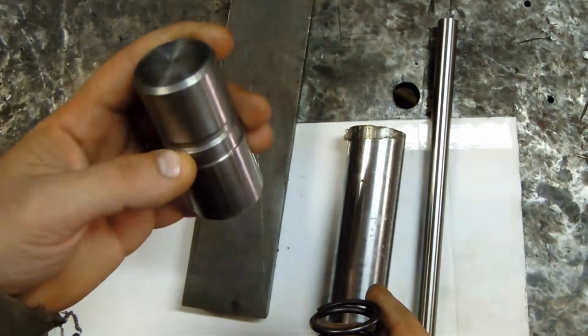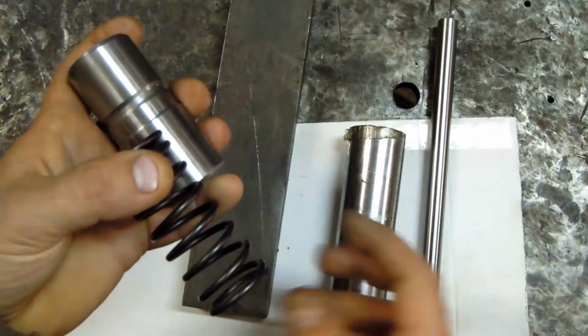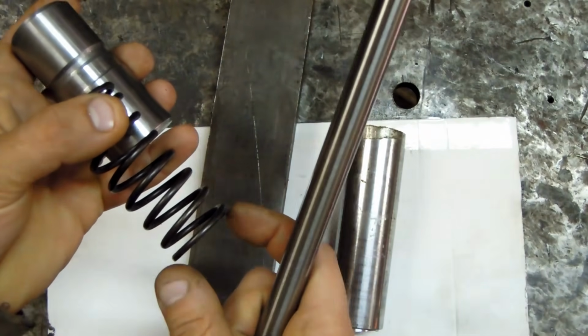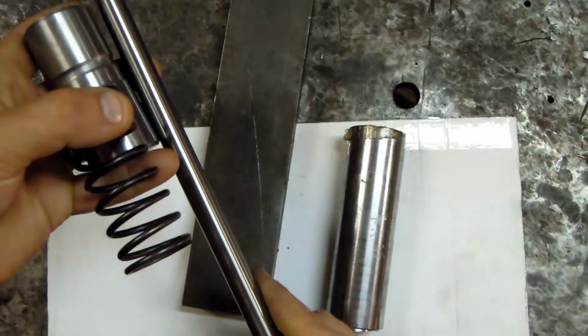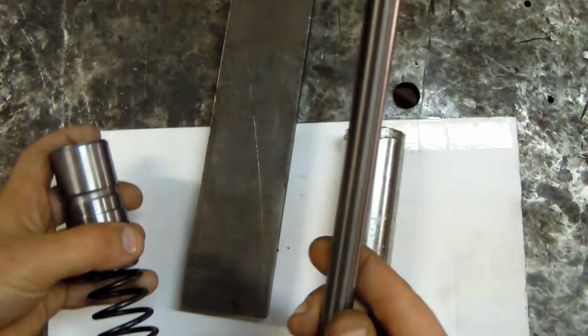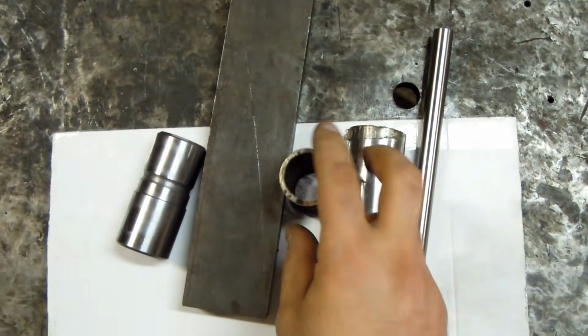That's the attachment that you guys saw in the shop post build. So I'm thinking just a shoulder to hold the spring, like a floating donut, let's call it, to act as a stripper, and then this punch on the inside. And hopefully none of this will move around too much when I try to heat treat it here in the garage.